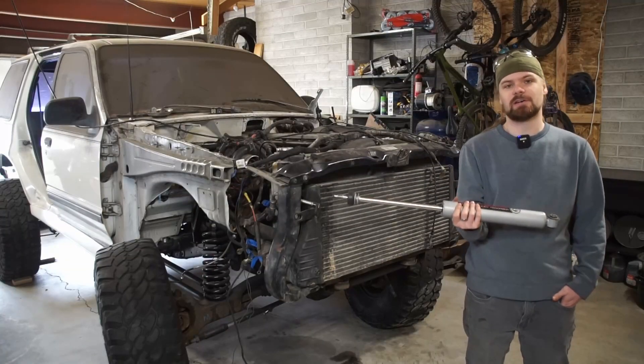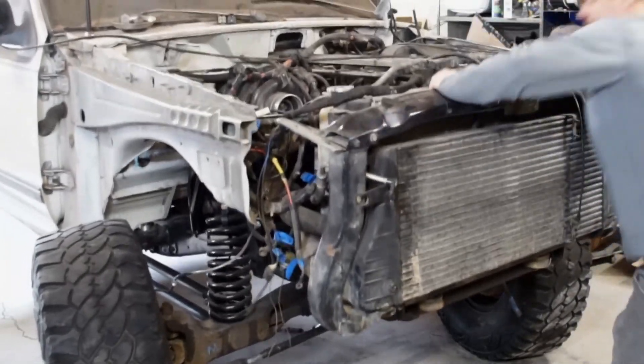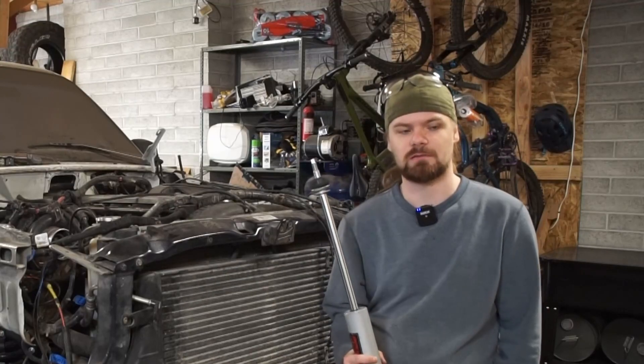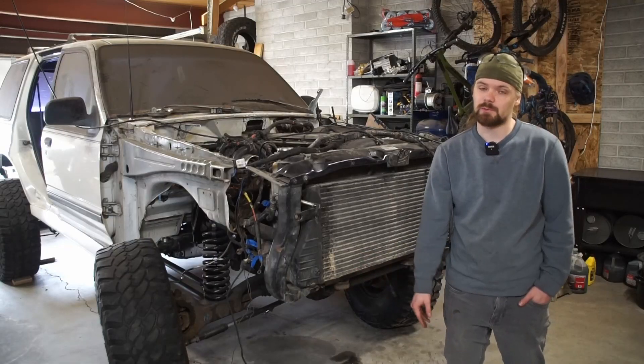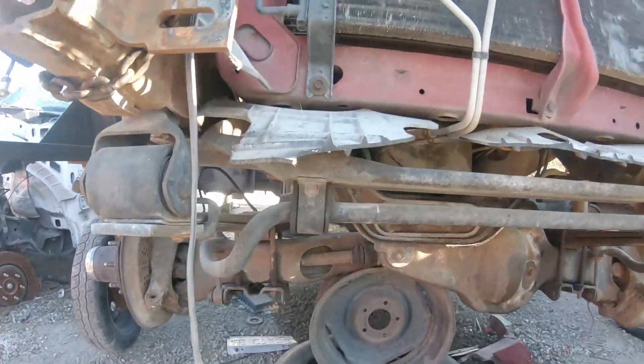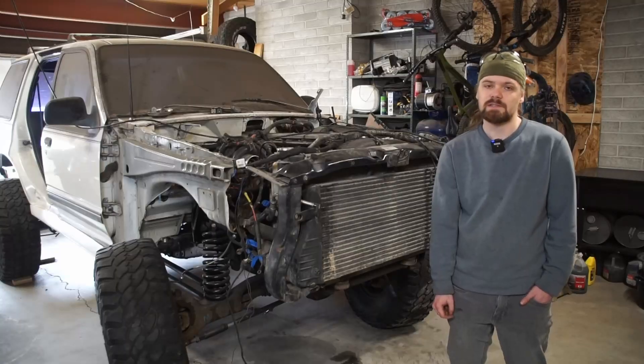For example, the front shock is sitting right here — this needs to be in the car. I can't drive it if the front end's just bouncing. I gotta damp that. This is a pretty tall front shock, and it doesn't fit on the stock suspension. Nothing about the suspension is stock anymore, but you know what I mean. Despite what the YouTube comment section wants me to do, this thing has TTB underneath it — from a 3-quarter ton F-250, which was very cheap, about $200. I personally like TTB. They're a jack-of-all-trades, do-it-all kind of axle. Solid axles don't like going fast for the most part, and while I do plan on rock crawling in this thing, I don't live in Moab. So I want it to ride nice and go fast off-road, not just rock crawl. In today's video I'm going to finish getting the TTB set up, and by the end I'm hoping to show you it's not as bad as you might think — quite a bit of travel out of a near-stock front end with lift springs and tall shocks. Let's get to work.